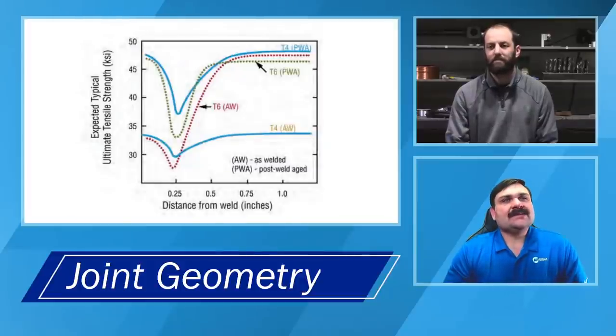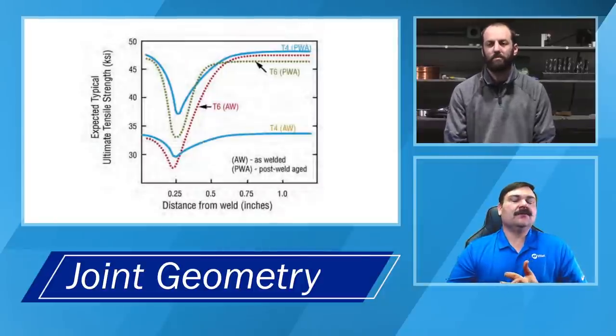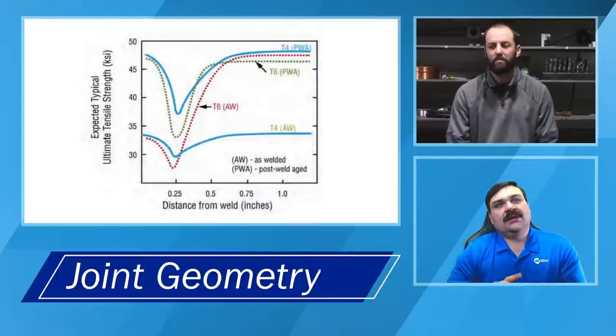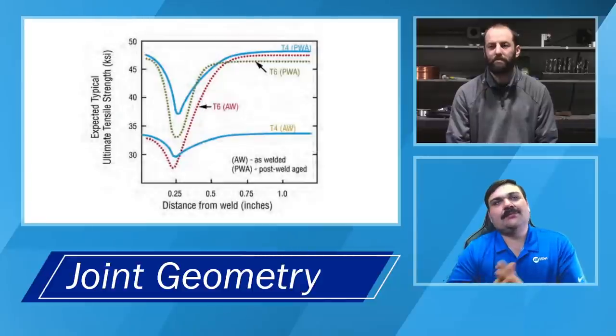Another one that we got is, I found it beneficial to pre-clean the aluminum oxide and then preheat to about 200 to remove moisture. I'm assuming that's two different steps in one: actually brushing or chemically cleaning the aluminum oxide, then preheating it.